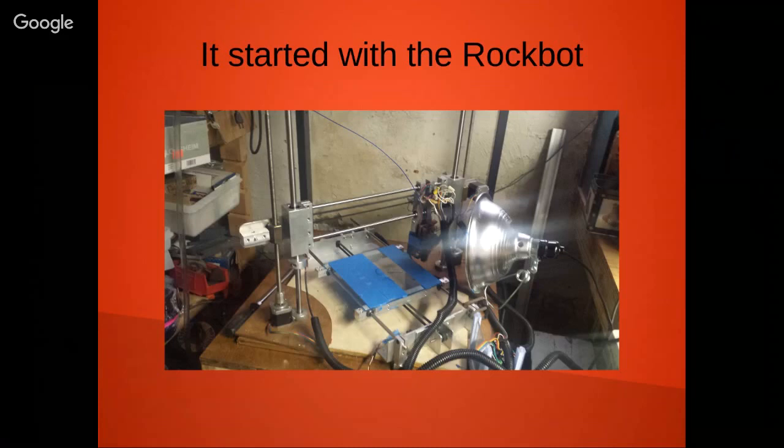What was really interesting about this was I had laid these tiles down on my surface plate at home, and I was getting stiction on it. And I thought, for the cost, that was just crazy that I was getting some really good flatness for a really cheap price. So on this particular design, I basically had angle iron that I bolted straight to the table, machined some holes into the angle iron, and I got a really nice system, really rigid. Used some diamond core drills. That was getting a little fancy here to put the vertical posts in there.